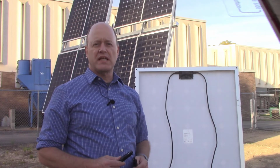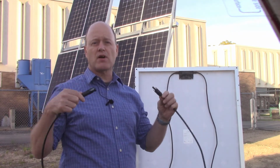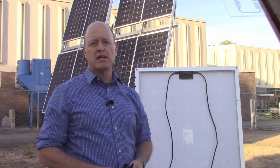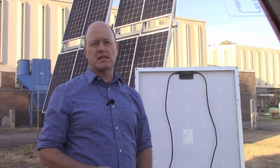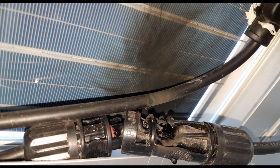The arcing you've seen is why modules should never be connected in or disconnected from a complete circuit in the light. Connecting or disconnecting in the light will damage module quick connects. Here is an example. These module quick connects were probably never quite click locked. Over time, arcing, carbonization, and melting brought on complete failure in the wiring of the PV array.